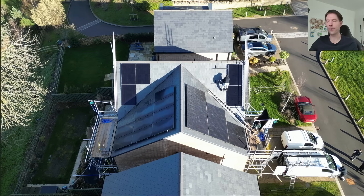I chose not to add optimizers to any of the panels on the string inverter because the level of shading is very low, and I didn't want to add more hardware to the roof than strictly necessary — these things can fail and I'd rather keep it as simple as possible. If I didn't need to add optimizers there'd be no point. What I'm interested in doing in a future experiment is adding optimizers after the full year is over to see how much of a difference it would actually make, giving us another comparison between an optimized string array and the naturally optimized microinverters.